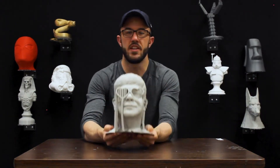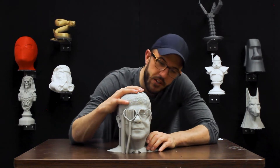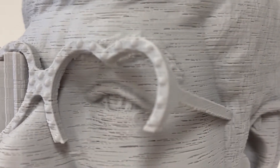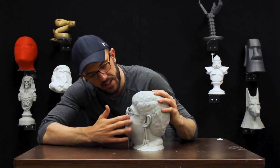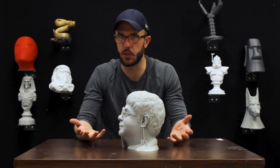This one right here — Elf & John — true classic. If you look close at this, you will see holes, skipping, and jaggedness to the texture of the skin and everything else. This jaggedness is a continuous lack of extrusion — under-extrusion.